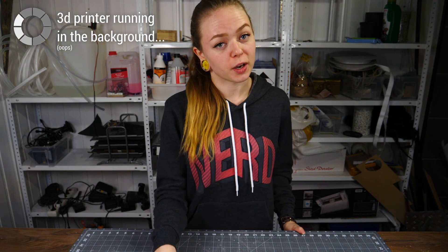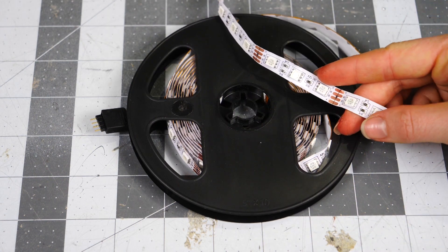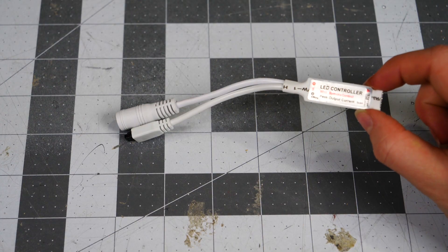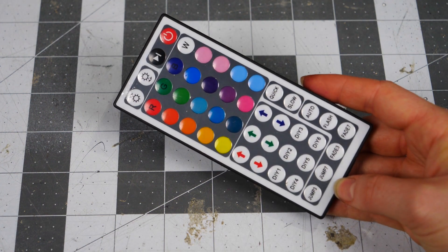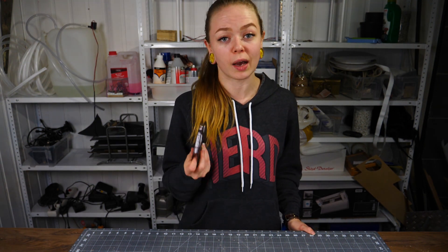If you're new to this channel, you might not know that we have used a lot of RGB LED strips in the past, and I really enjoy using them for lamps because it opens up so many possibilities. You can get a lot of different looks — even cold white or warm white if you prefer — but you keep your options open, and that's what I love about them. What I usually use is one of these LED controllers, and with it comes a remote control where you can control the color, patterns, and stuff like that. It's easier than you might think to wire this up — you just have to solder four cables onto it, and I'm going to show you how. The link to everything is down in the description.